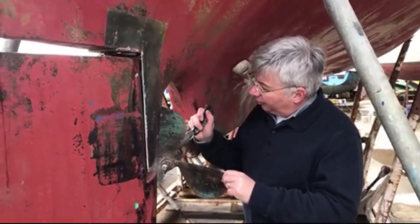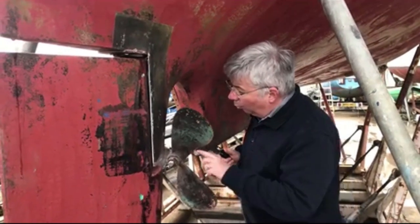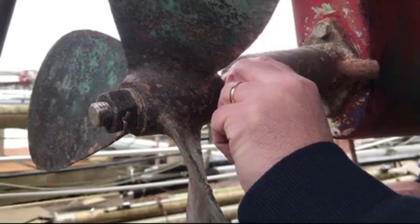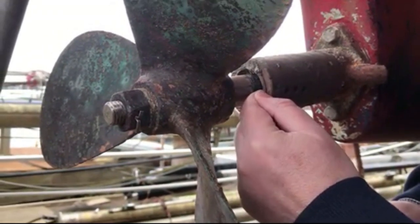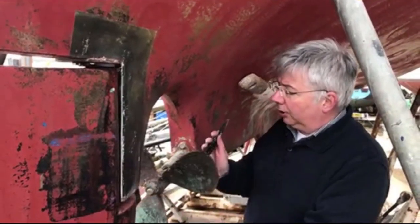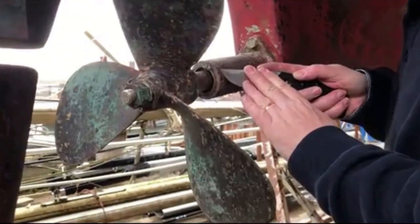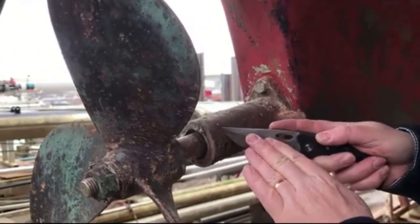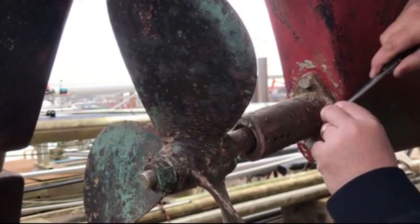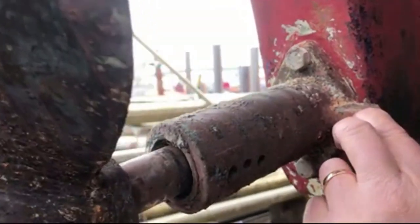It used to have an anode on the shaft here, but that is depleted and fallen off, so it needs a new anode. The shaft is actually worn — you can feel it's quite pitted — but that doesn't really affect it too much because the important part is up inside the cutlass bearing housing. Before too long it's going to need a new propeller. I'm now going to scrape on the cutlass bearing housing — it should come up as a nice yellowy metal underneath, but it's dull and pinkish. It's salvageable, but you can see that brighter yellowy color is what it should look like.